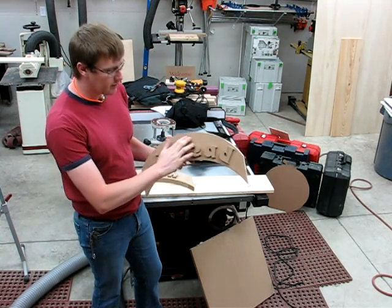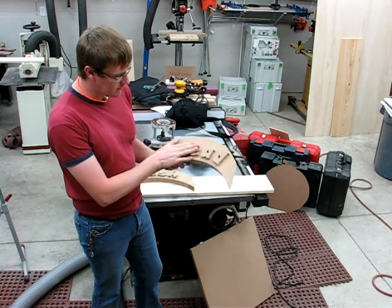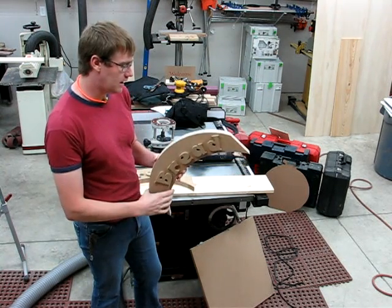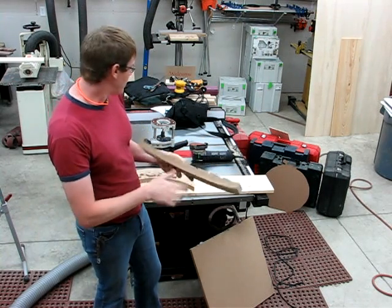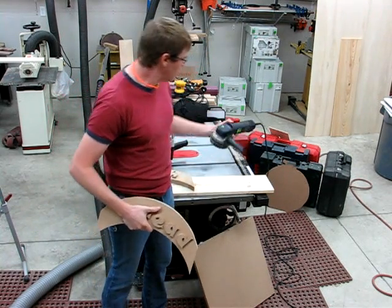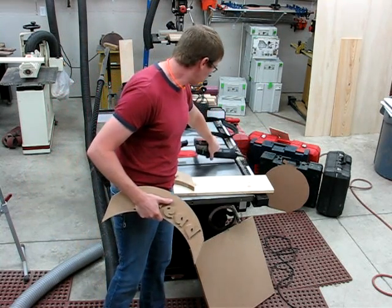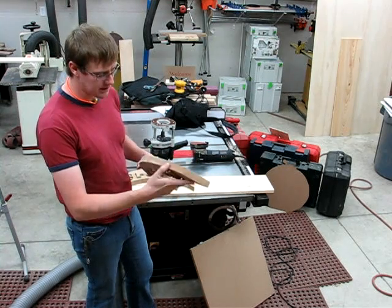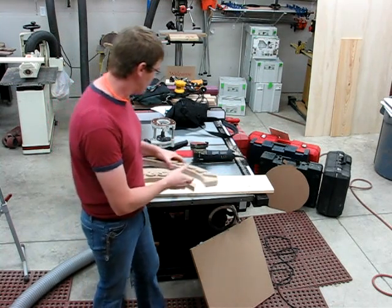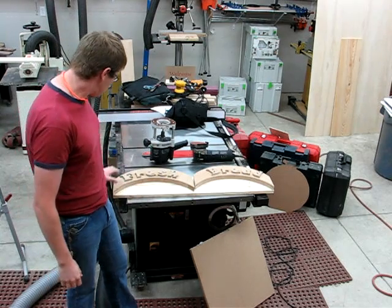As we machined away most of the top board here, it just tends to bow like a potato chip. So we're done with that. I went around the outside edge here with the Festool RAS115 with some 120 grit paper, just to smooth down any difference between the two of them, which I think turned out pretty well here. So now we're ready to go ahead and make the top part of our cabinet here.